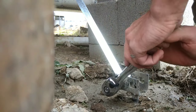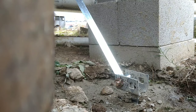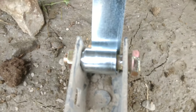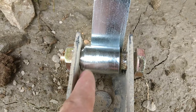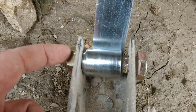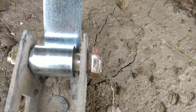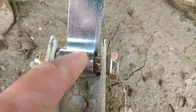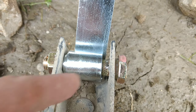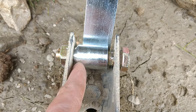At this point I made the mistake that I said not to make at the beginning — and this is a good object lesson. You see how my strap was not aligned over itself? Because of that, it's worked its way over this way. As I tighten on this side, it can't go any further because the strap is preventing it from seating. I've got this square halfway seated, which is not good enough. I'm going to have to loosen this side, pull this back out, loosen this, scoot it over, and do this over again. If you don't want that to happen, just make sure you don't let this slide over there.